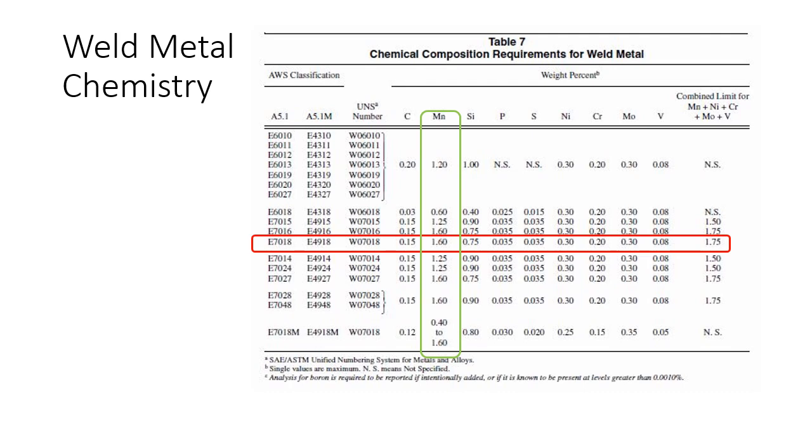Well, if we're doing 7018-1, if we're making a batch of that, if we're the manufacturer, we'd probably want to have the manganese up around 1.4, 1.45, 1.5 on the upper end of that, right? It's still 7018. It still falls into the 7018 category, but it's got a higher manganese content, so that means it's E7018-1. And that's the difference. I think it gives it better impact strength and where you need a lower transition temperature.